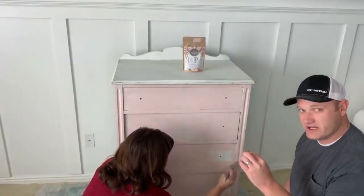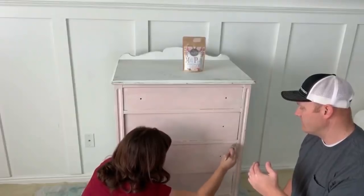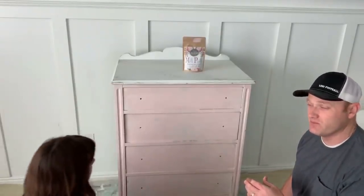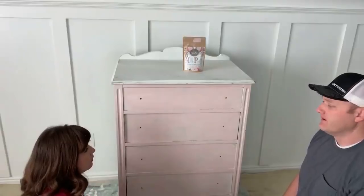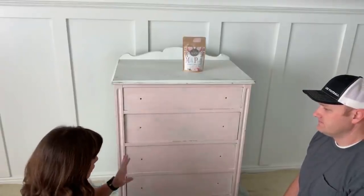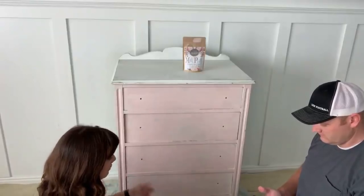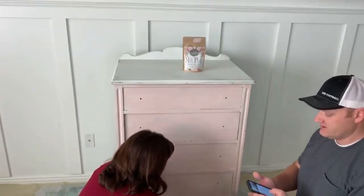It's going to start to show you where it's going to chip and crackle. Usually you can get away with two coats — if you want super solid coverage you might need three. Most colors will cover in two unless it's like the flour sack white color. When you're done painting it, go over it with fine sandpaper and it will get real smooth and get rid of a lot of your brush strokes.